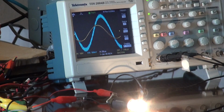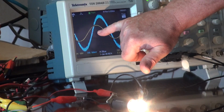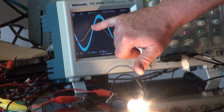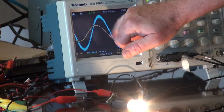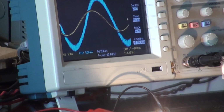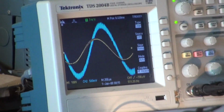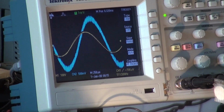And now we're on the regenerative acceleration coil, and again you can see the noticeable delay in the yellow current. The yellow sine wave is the conventional coil load current, and the blue sine wave is the ReGenX coil load current. And it's the load current delay that's created in the regenerative acceleration coil that allows it to reverse the EV regenerative braking paradigm.